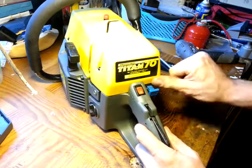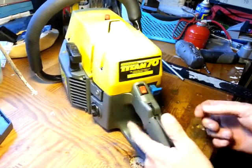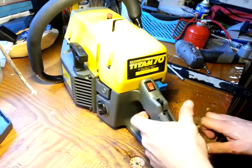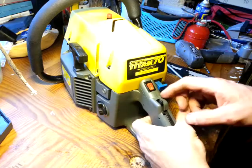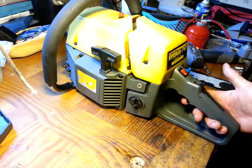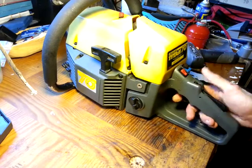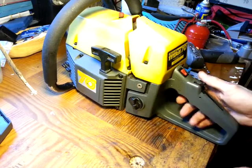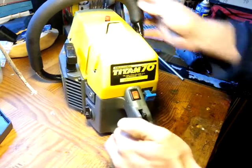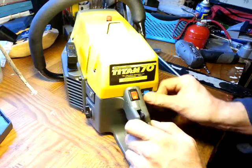The choke just governs the choke — it doesn't have any effect at all on throttle. For starting: set at half throttle, dead man's handle, trigger in, and that locks it at half throttle. It's a reasonable design. It all feels slightly overbuilt, so it's pretty difficult to snap any of this stuff off.